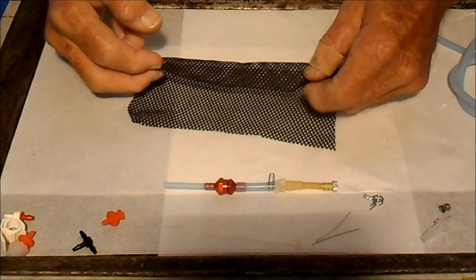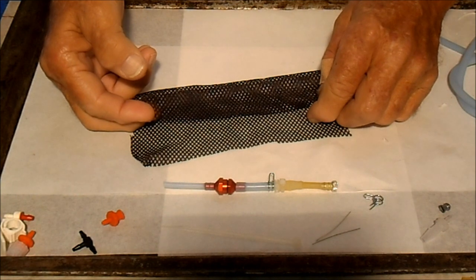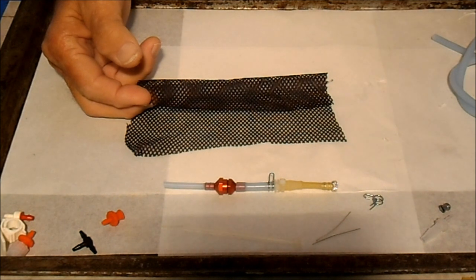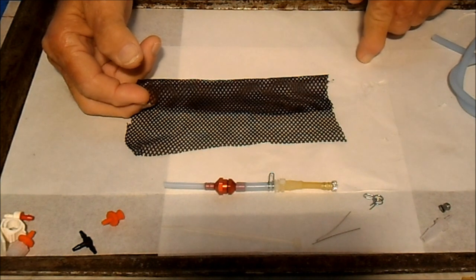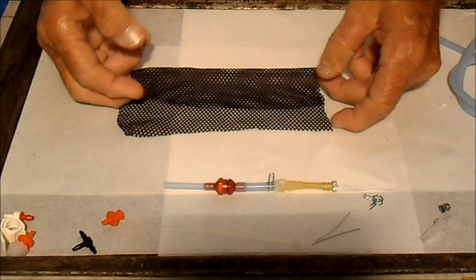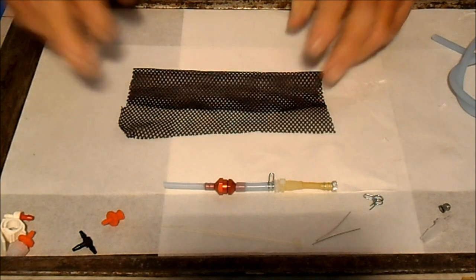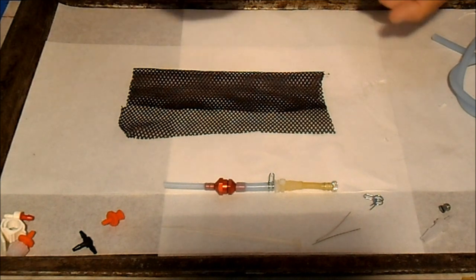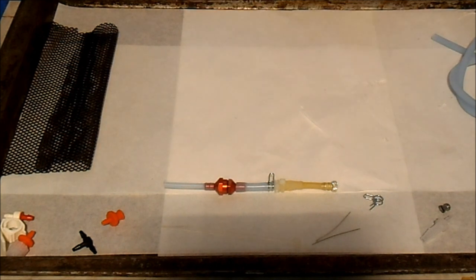All I do is roll it over, estimate the size that'll contain the bladder without constricting it. You want to make sure that there's no false pressure on the outside of the bladder and give it plenty of room to expand, because any false pressure will cause the mixture to be wrong when you launch, and then that'll cause it to lean out in mid-flight. So fold it so that it makes an appropriate size tube, cut it off, run a bead of epoxy down the edge and let it harden. And I do it on paper like this so that when the epoxy hardens, I can just cut it off, and it leaves a nice hard strip that you can use to help align the bladder when you mount it on the plane.